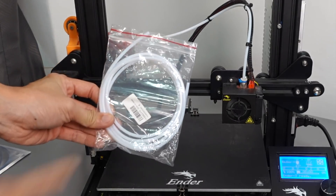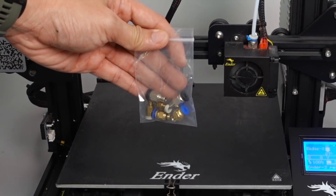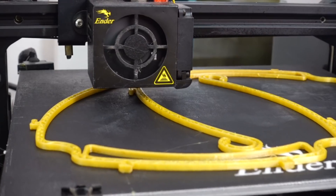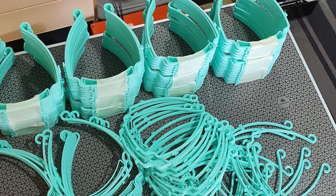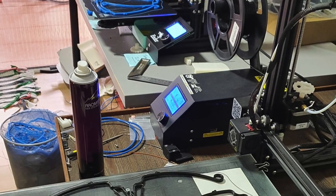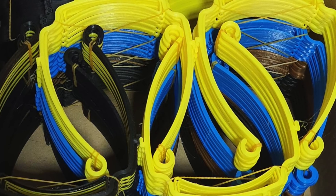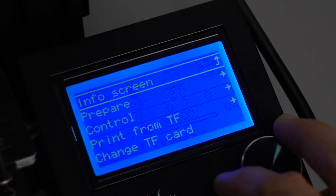I've been stocking up tons of PTFE tube, pneumatic couplings for the hot end and extruder, and also nozzles. Since last year, when all my Ender-3 print farms were printing PPEs for the frontliners and running for hundreds of hours a week, all this wear and tear dies off pretty quickly. This time I'll be upgrading to a high-quality PTFE tube together with the pneumatic coupling and a new nozzle. Let me show you the best way to do it.